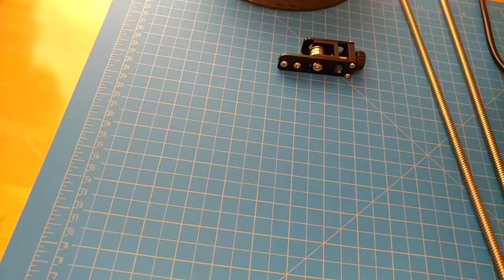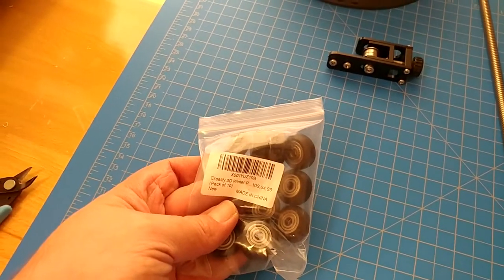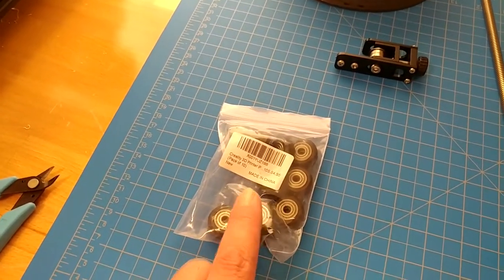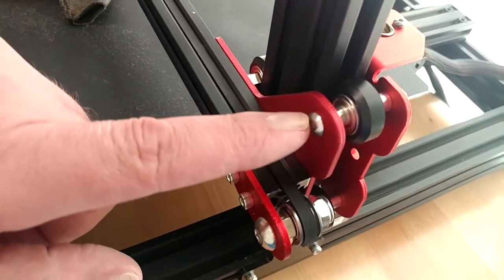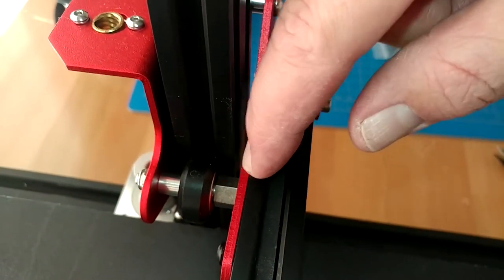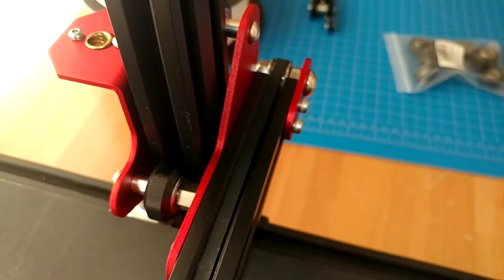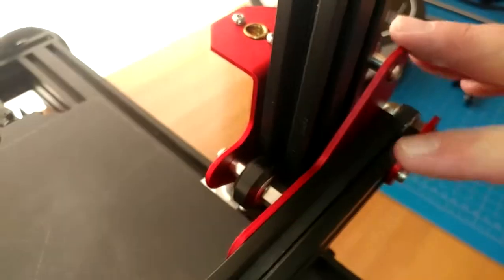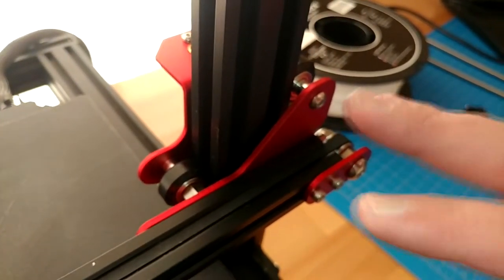So I'm probably going to end up replacing those. I could probably get Creality to send me some, but new ones — like this 10-pack here — are like 50 cents or a dollar a piece, so it's not even worth messing with. I'll throw a link in the description. There's not a whole lot more going on than what is obvious — you just take the nuts and bolts out. There are spacers in here on each one, and in some locations there'll be cam nuts to keep track of, but no real big deal. I'm just going to pull all these rollers off and probably replace them all, because it's not very expensive and it's not very hard.